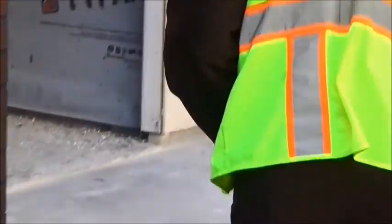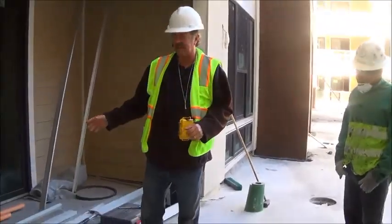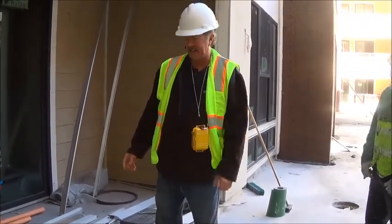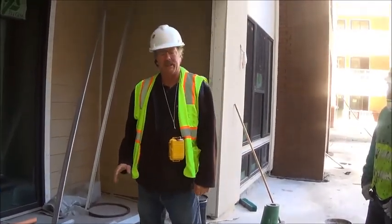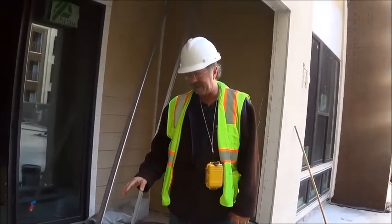Okay, next one. The thing we've got to watch out for is if all of a sudden we find out we're putting ceramic or whatever, porcelain tile out here. The adhesive manufacturer, as soon as they see hot rubber, they're scraping it off. We just got to be careful what they're going to do here. I always tell them, don't scrape it off. Leave the hot rubber.